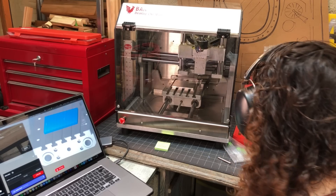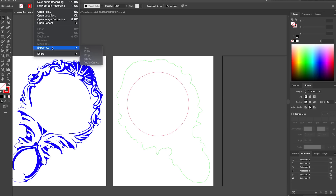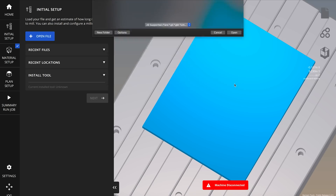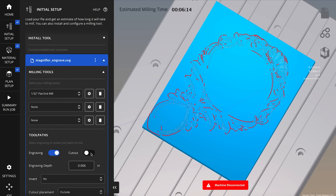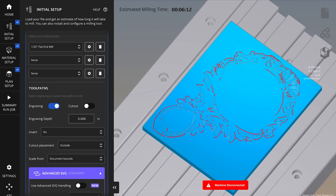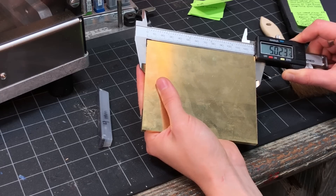After the first successful milling operations and a few engraving tests, I was still ramping up to learn CAM, so I wanted to see just how far I could get with the built-in SVG functions. I measured a small magnifying lens and designed a simple two-sided graphic in Illustrator to mill in solid quarter-inch brass. Setting up the file in Bantam was pretty easy — the basic SVG function lets you differentiate between cut and engrave for different paths using color coding, much the way it works on a laser cutter. You can choose multiple tools for the job and set the depth and position of the file. For software subscribers you have a little more control designating inner and outer cut paths within the same file, but you can still achieve the same finished product with the basic features by importing files in separate steps.